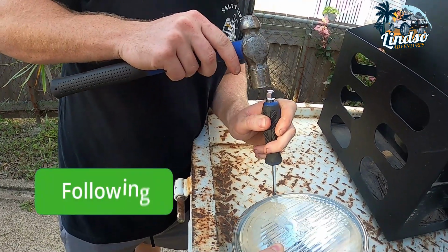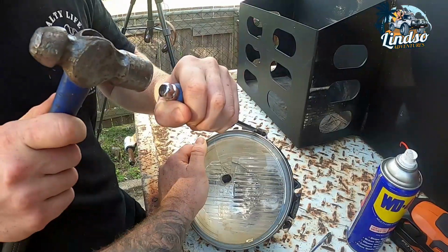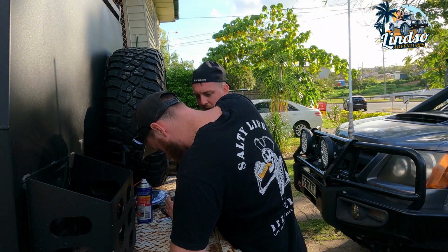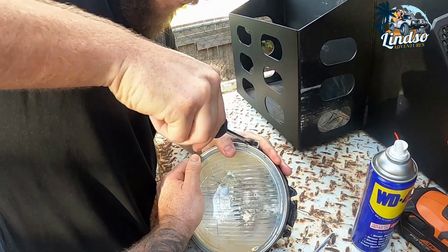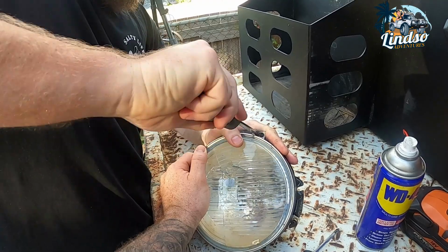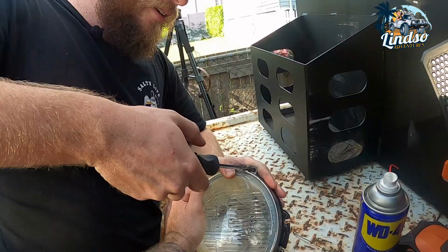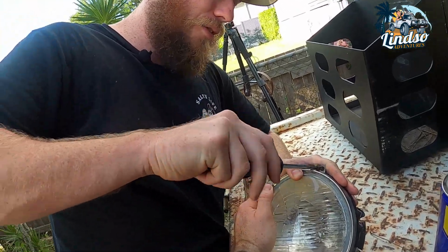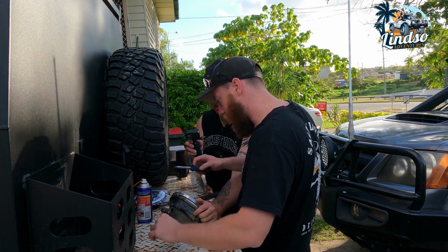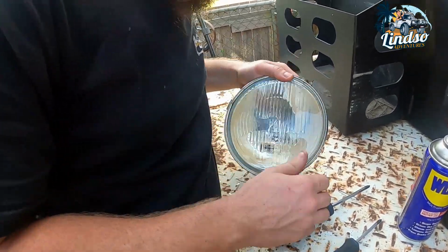So what we do, just give a little tap, because it's probably a seized up screw. I see. So it's by banging it so you can put your screwdriver in? Yep, there we go. They strip out otherwise. So you just give it a tap, like what I just did, just to pop it. It kind of vibrates it, and frees it up so it's not seized. This one might be a bit shit, but we'll see how we go.